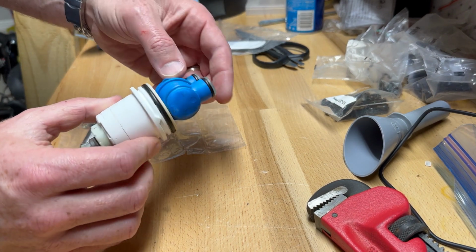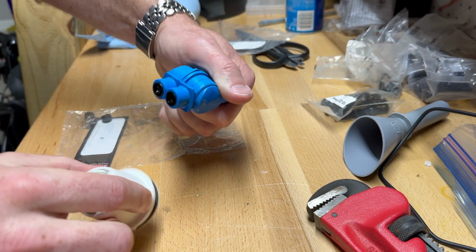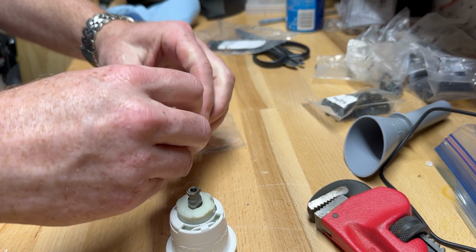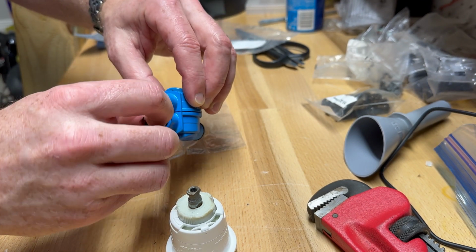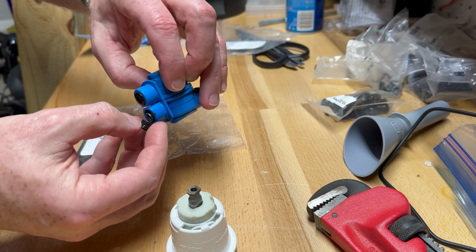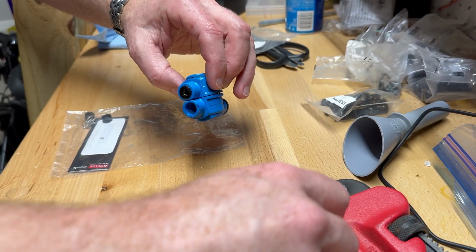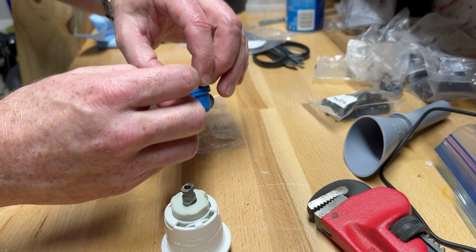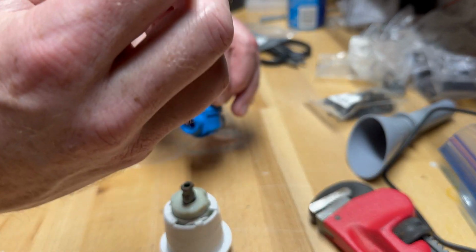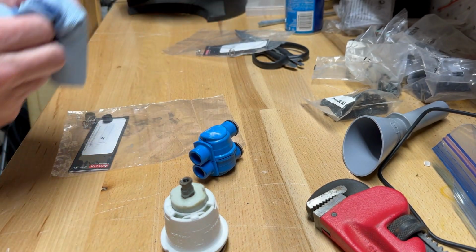So anyway, I've got the cartridge here, and I'm just going to twist it like that. Now I've got these little rubber gaskets. I'm going to pull one of those out, and the spring, the tapered side was towards the spring, and you can see I'm getting black all over myself, so I'm sure these are just disintegrating. We'll do the same with the other one. And you can see again the taper was there, so I'll put these new ones in, wipe my hands a little bit.